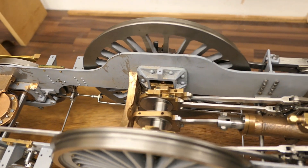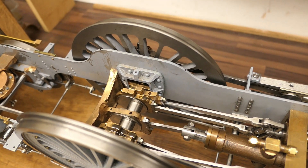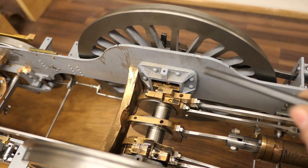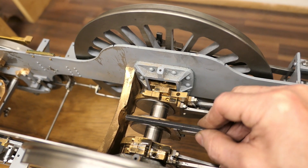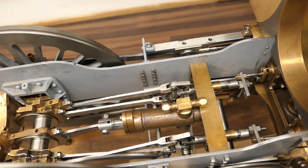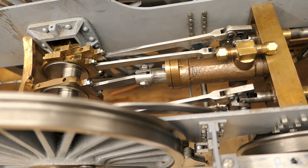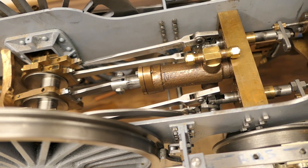The other thing — which I think other people have mentioned as well — is that the Stirling Single, if you follow the Reeves design, the clearance underneath the boiler is very, very small. So I've done a couple of things. I came up with a new eccentric which, instead of being split vertically, is split at an angle, which means I can get a much lower height on the eccentric than normal. The second was the water pump — I've deviated from the Reeves design and reduced the height of this boss, and also made a low-profile T-piece for the water pump.